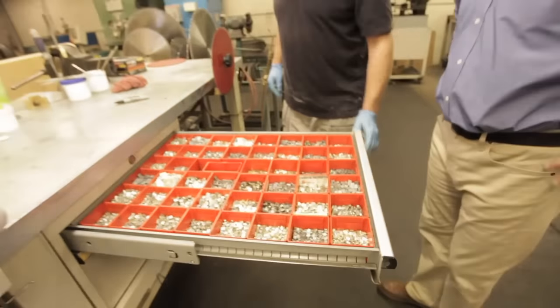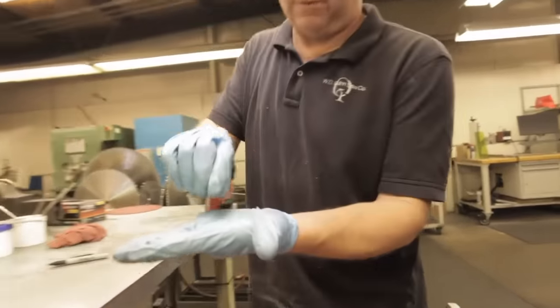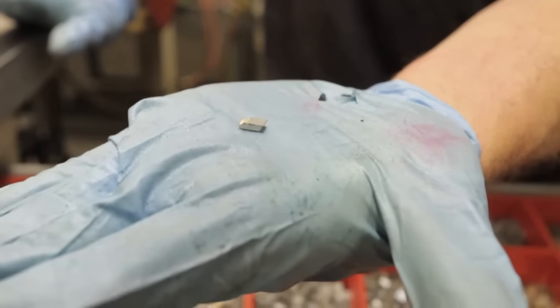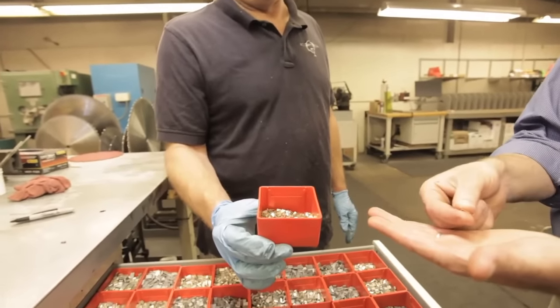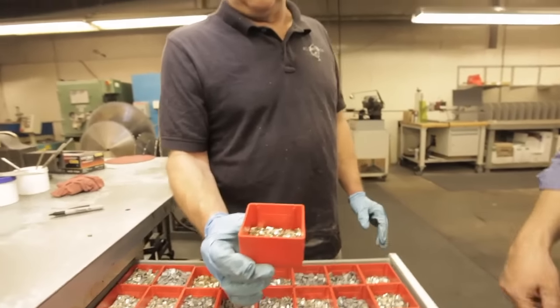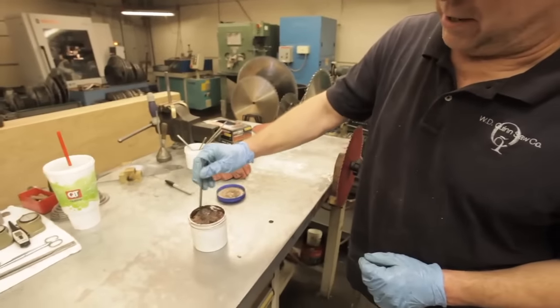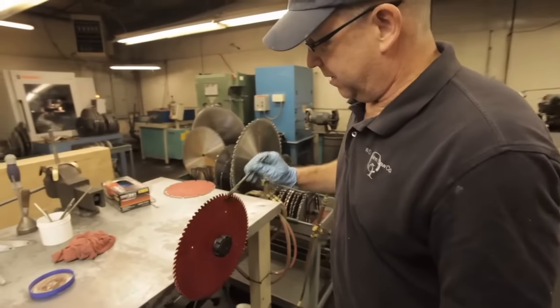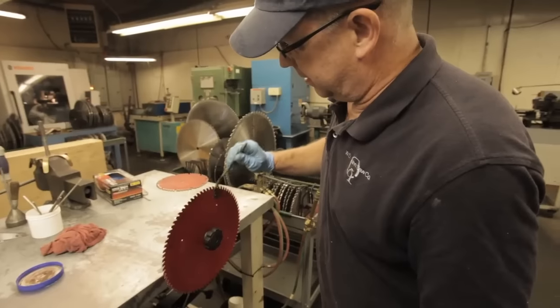Right here I've got several choices of carbide tips. I've already identified one of the tips that I would use. That's the tip I would use on this blade. That's the shim material — that's what will melt and act like glue that attaches the carbide tip to the steel body of the blade. The next step is we have a flux material. I'll use a brush on the two areas I've identified and put a good coating of this flux material on there to protect the blade.